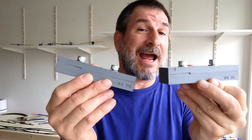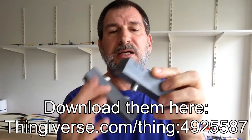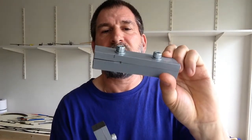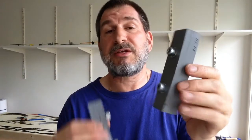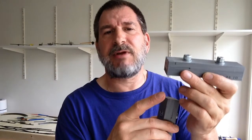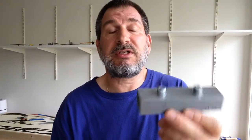I made them up for number 4 and number 6 and put them up on Thingiverse. It's a fairly long print because it's a fair piece of plastic, and there's M8 hardware — two M8 lock nuts buried inside and a couple of M8 screws on top with some washers to help spread the load. You have to put all the rails in; you can't just put half of them in, because it really won't work so well. Put a pair of blank rails on the other side if you're only doing frogs or just points. For the most part it works the same as the metal block, and I was really quite happy with the results. If you're making 80-plus turnouts, this will save you a lot of time.